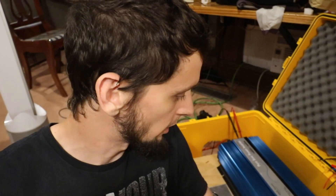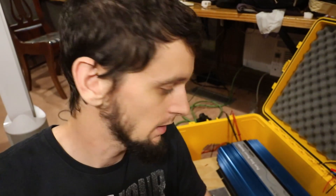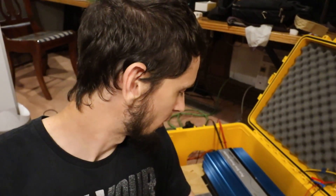This 5000 BTU unit has a soft start, much softer than my old 8000. So it's very possible that a newer air conditioner with more modern technology will start on this even if it's larger. The fan cycles on and off rather than running full blast, which is great — so the inverter isn't drawing a lot of amps at idle, about 15 watts. Paired with my 3.8 kilowatt hour battery, I could run the 5000 BTU air conditioner all day long on solar, then about seven hours running full blast off battery, or all night if it's cycling at a reasonable temperature. Right now I've got 53.6 volts left in this battery, so probably two to two and a half hours or more of running that air conditioner.